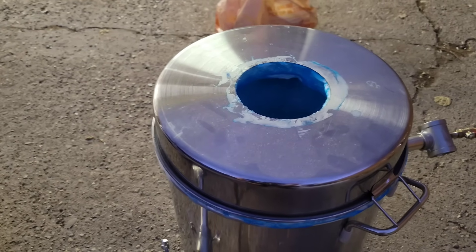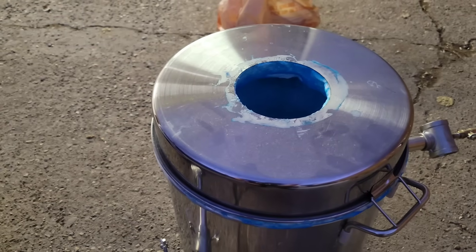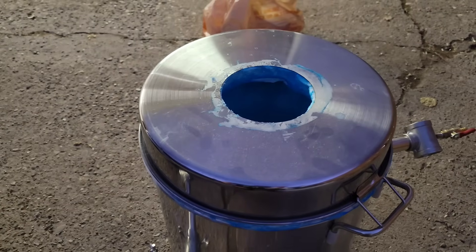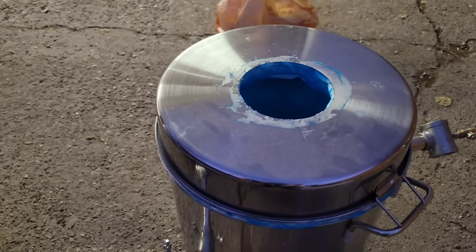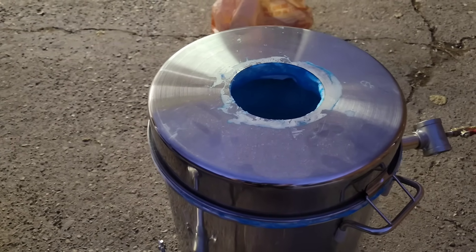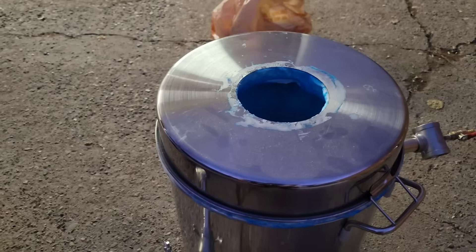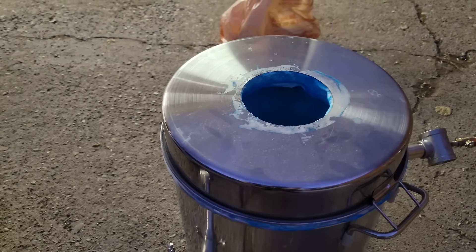This rigidizer will help essentially just clump onto the fibers and keep them in place — that's what's gonna protect you from the fibers. I'm gonna put that through a quick fire just to make sure everything's working well and then I'm gonna line it with some bentonite clay, which will protect the fibers from any of the metal. It's not as good as castable refractory but I'm still waiting on that to come through the mail, so for right now I'm just gonna put a quick coating of that bentonite clay on it.